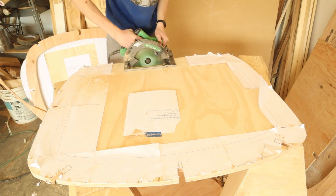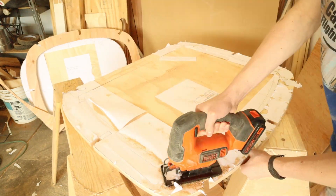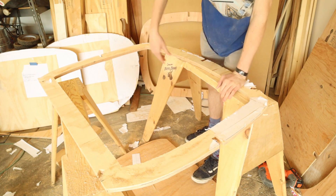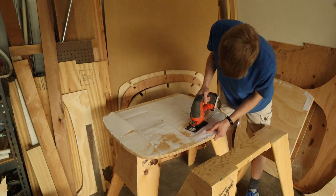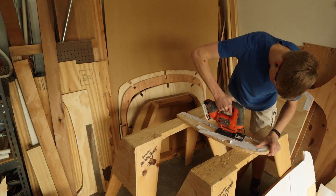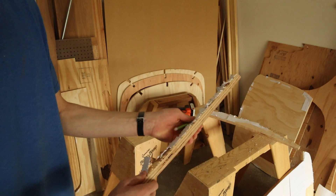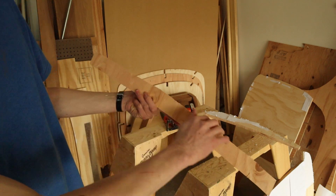I'm going to redo the same thing — make a plunge cut here, but this time with sawhorse awareness. I made a mistake right here: I probably should have had the plywood oriented so that the grain pointed this way, but instead they're pointing up and that led to some pretty unclean cuts. I can now sand these pieces down to make them smooth and put them together.